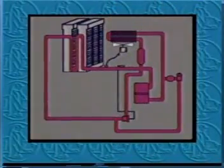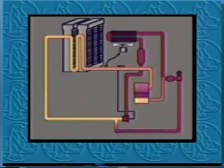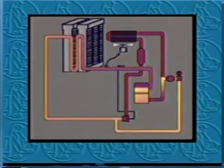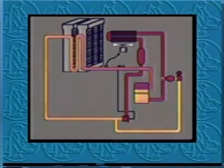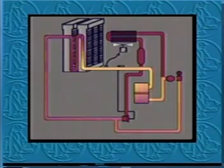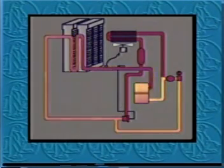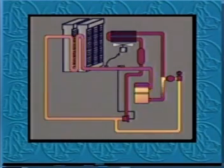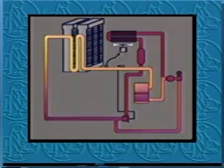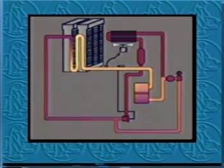First, hot gas from the compressor enters the serpentine coils of the evaporator while the inlet water valve remains open to assist in the harvest. This causes any ice remaining from the previous cycle to be released from the plate while water continues to fill the reservoir. Starting the compressor in the harvest cycle with the hot gas valve open provides a no-load start, better efficiency, and longer life of the compressor and components.